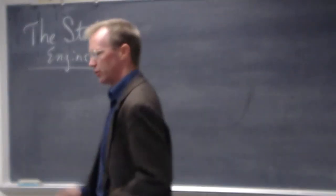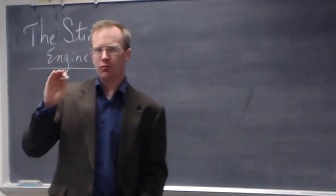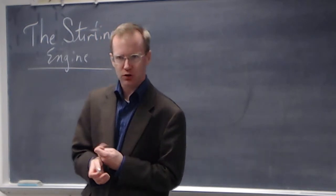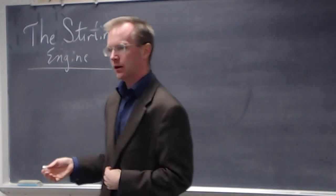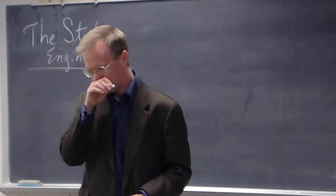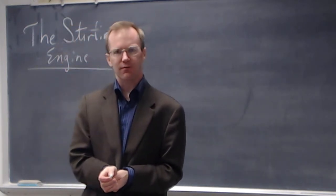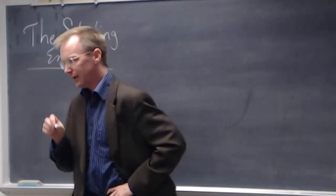The Stirling engine is something I want to describe briefly, which is an ingenious heat engine that is run at pressures very close to atmospheric pressure, so that you never have the really high pressures involved in the steam engine, which had led in the past to boiler explosions and people getting killed when things weren't run right. It was the human danger in those that led Reverend, I think it was Robert Stirling, to invent this engine in, I believe, the very early 1800s.